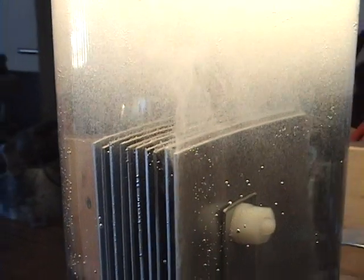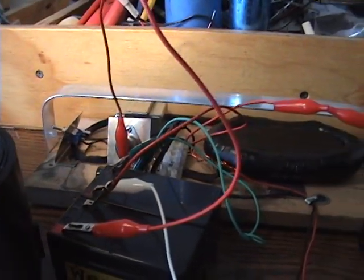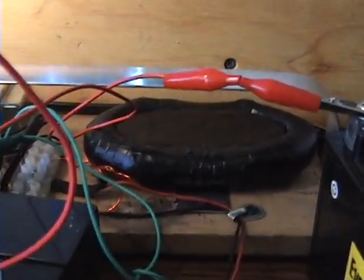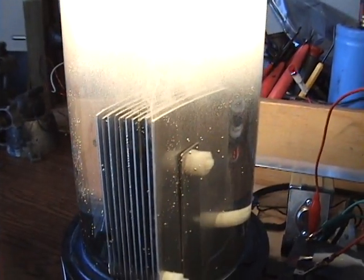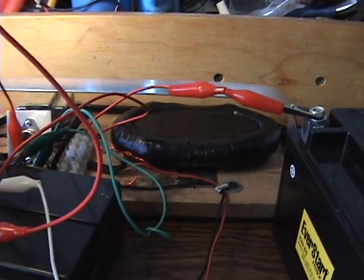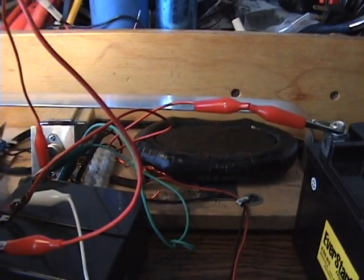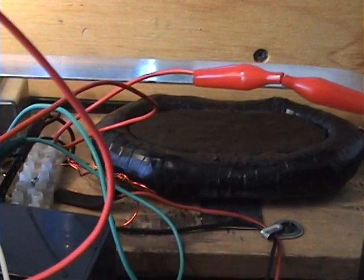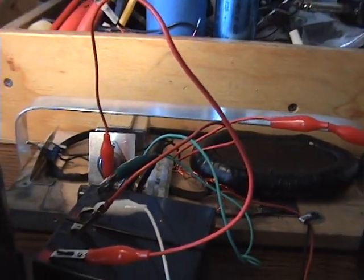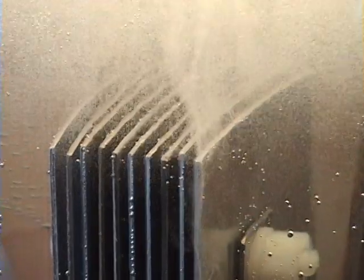It's really just all about high voltage and getting the right frequency. The reason you need the right frequency isn't because it performs magic — it may perform magic if you're using sound or vibration — but really, it just cuts your power draw down because that coil is tuned to this water. You're not wasting any power in excessive dwell by overcharging the coil. The coil doesn't even get warm. It's just like an automotive ignition: the coil should not get warm if you have the proper dwell. Dwell means charging time — you don't want to overcharge the coil in between pulses. This circuit has a perfect dwell where the charging time is just absolutely perfect. We're not wasting any power and yet, look at this, we're getting hydrogen.